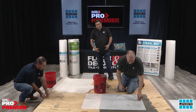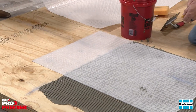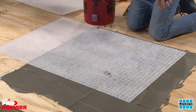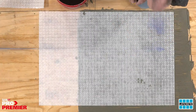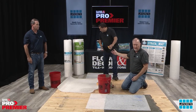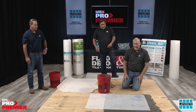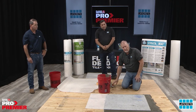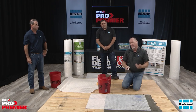Can you walk on the mat right now to install tile, or do you have to wait for the thinset to dry? No, you can install right away. You can do the whole room and install immediately. We'll snap a chalk line on it — one other benefit of this product is it accepts chalk lines clearly, which you can see on the surface aiding in proper tile layout.